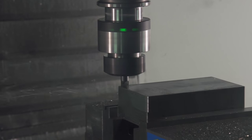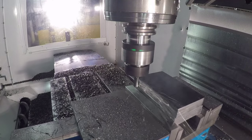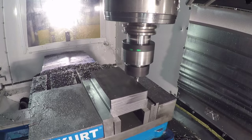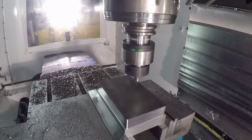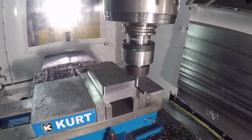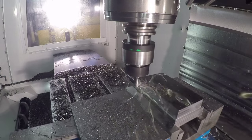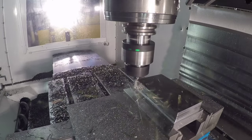I mention making a full pass around the part because your first pass may be a little lighter or a little heavier based on the size of stock you've loaded in the machine. As a quick trick, it's always a good idea in CAM to define the stock a little large so that first pass errors on the side of being light, if anything.